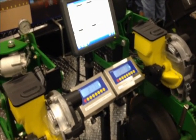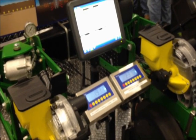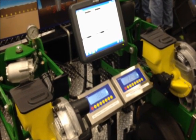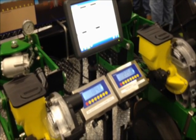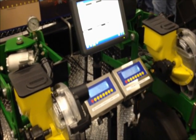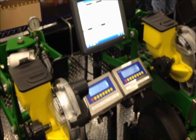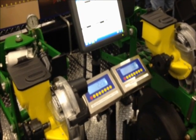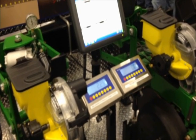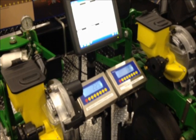Right now the systems are basically balancing out. The air system is holding about 230 pounds of ground contact; our hydraulic system is running about 184. We let them react and max out — right now the hydraulic system is already maxed out and the air system has yet to respond. There it made its first response, and it's still trying to increase.